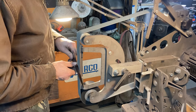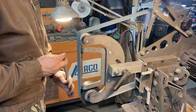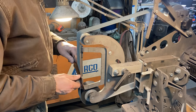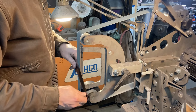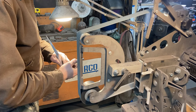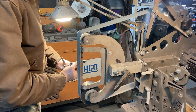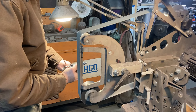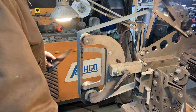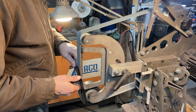The edges on these are nicer for plunge cuts. Just trying not to heat things up too much, grinding without gloves, making sure to keep everything cool. We're just trying to take off any nasty 36-grit scratches and thin that edge down the last little bit. We had been about 30 thou going into heat treat. Now we're taking it down to a flat grind of 20 thou — dead flat grind from the spine down to 20 thou. Then we are going to slightly convex the lower third of the blade down to about 5 thou. You can see me going with the micrometer — I'm at about 10 here. I'll keep going once I get down to about 7 or 8, convexing that last little bit, very subtly.